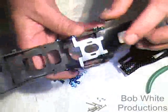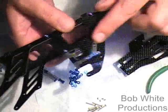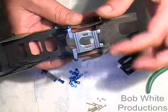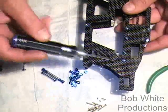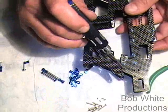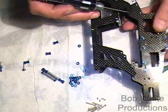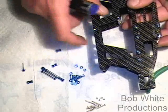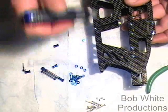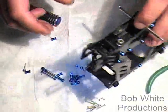We've got the lower frame on the plate. I also attached the motor mount here with two screws but left it kind of loose because we need to get the frame aligned — the top frame attaches in between here. Now we're going to join the upper halves. There are three locations to join for now: these two holes that attach here and here, and you'll need these little spacers to go between the frames, and up front at the motor mount. We need to get those in as well. That's how we attach and line up our frames — three on one side, three on the other. It's easier to do one side first and then the other.